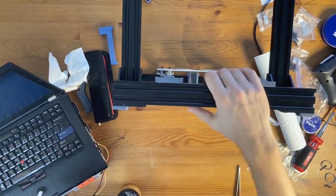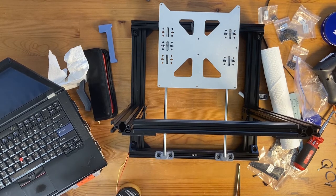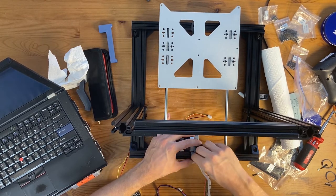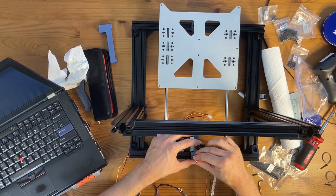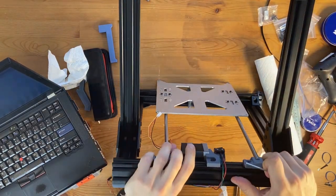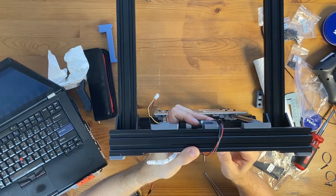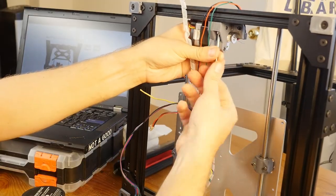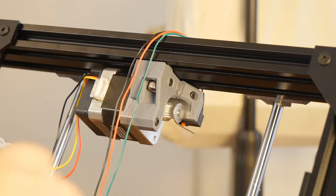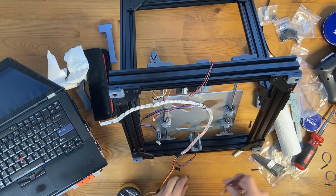Put the frame upright. And then slightly tighten the top screw. Then, yeah, I guess move the frame like so, and then attempt to tighten the bottom screw. So, oh, okay, I have a problem now. Now I tightened the bottom screw, and I didn't check if the T-nut was there. I need to move the T-nut around a bit so it aligns. It looks like I need to revert to my original method and just remove the screw. I know it's not going to get stuck, so let's just do this thing correctly.